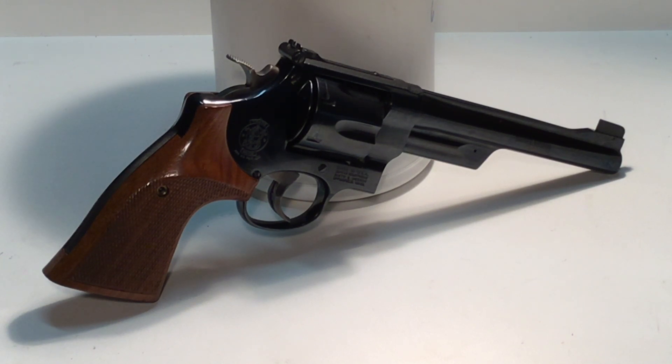There's really no need to slug a revolver barrel to determine the groove diameter because it really doesn't matter — what's important is the cylinder throat. The groove diameter of the barrel is going to be smaller than the cylinder throat, which is usually caliber specific. People think the groove diameter of the barrel is caliber specific, but on revolvers it's actually smaller.